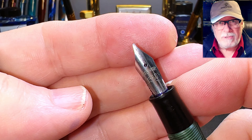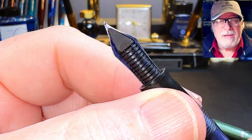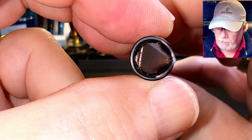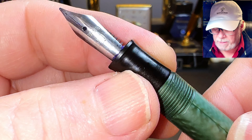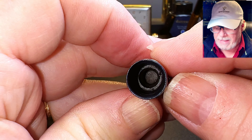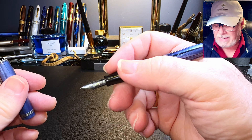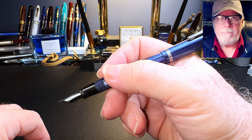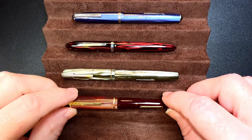Not much tipping material either. That's the blue one. Here's the green one — this one took a lot of time. This is the Esterbrook J and it has what I would call an extra fine steel nib. It's a little bit dry and still a little watery from me putting water on my micro mesh pads. But this is a lot better — I couldn't write with it at all before, and now it is relatively smooth. There's some feedback but I can actually write with it, where before it was just tearing up the page. I would say success on both nibs.